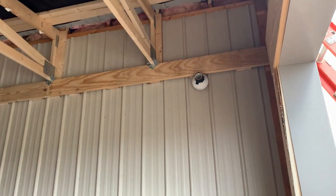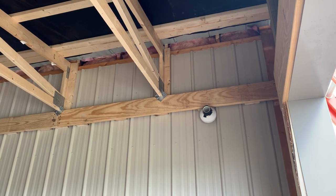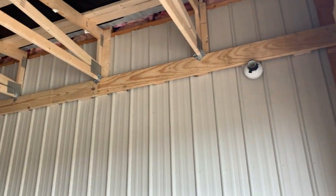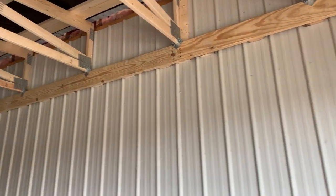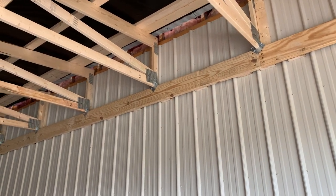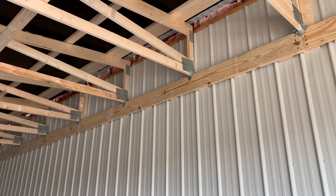That's obviously the sidewall steel. You can see how we connected those trusses right there — let me show you that in a little greater detail. Hurricane ties — you can see the hurricane ties stop the uplift. Although this building is a little tighter, still, Ottawa County has high winds, so obviously safety first.